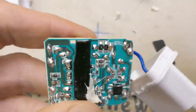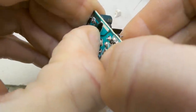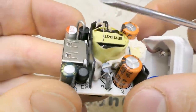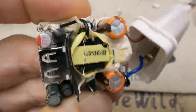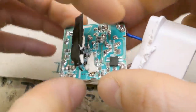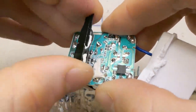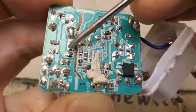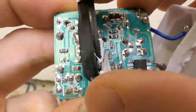And there is some insulation — it's probably insulating the safety gap between the primary and the secondary side. This piece of plastic actually continues and it's all one piece, sitting in a slot in the board and glued in. This is all for extra safety, insulating the primary side from the secondary side to ensure that the mains voltage can't get to the output. There is a big slot in the board, and while the distance between the two sides isn't huge, it has this plastic shield inserted, so it's quite safe.